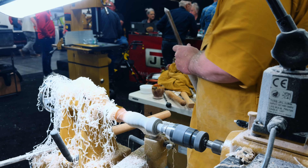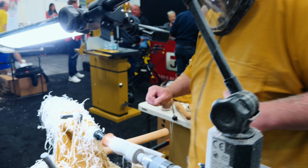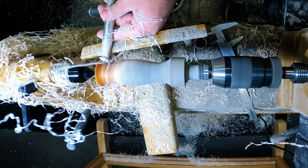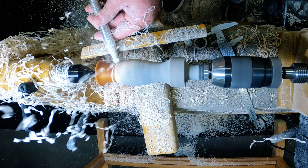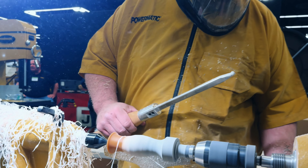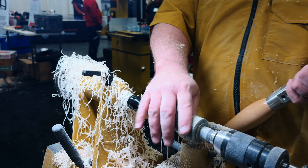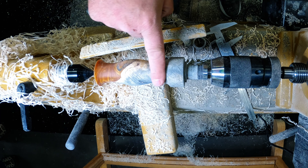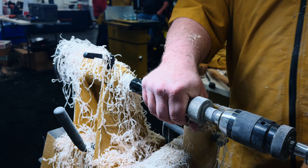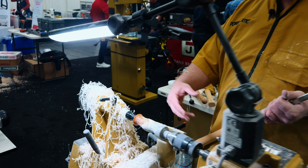One little trick if you're turning resin and you get this little mess: have yourself a toothbrush handy. Now I notice finishing this shape back here it's going to be just a little bit off, so I'm going to take my carbide tip tool and come back and just redefine that a little bit. Now the back part's done. I'm going to finesse the front — put a long droop stop right here. The purpose of a stop is so your hand doesn't slide past when you're scooping. So we've got this curvature back here and this curve here — mechanical stops front and back, plus it feels good in the hand and has a nice silhouette shape.